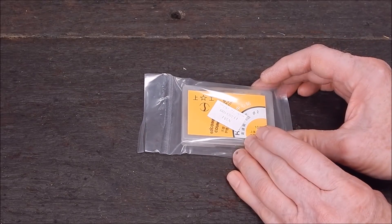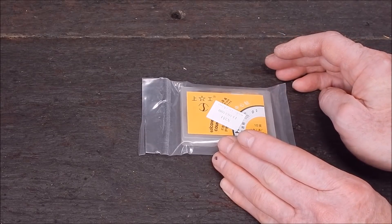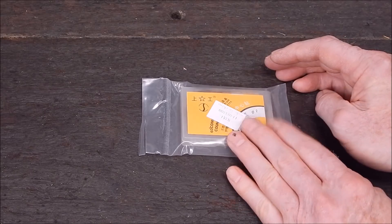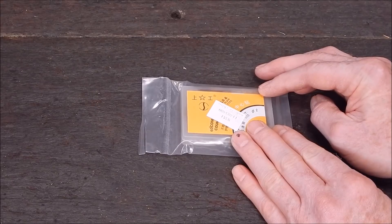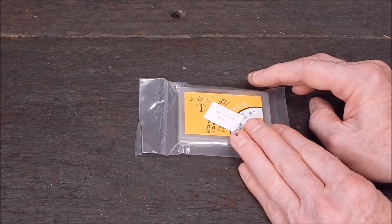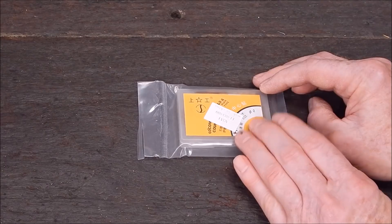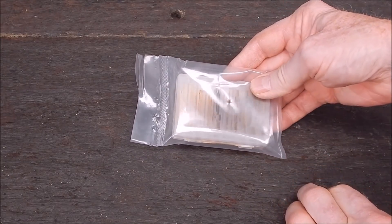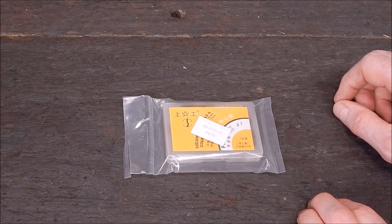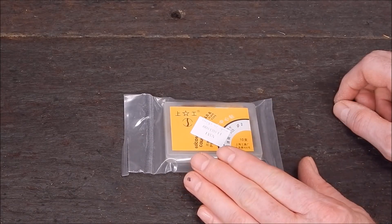They look to be nicely packaged. They're high-speed steel — pretty much all of them you see advertised are high-speed steel, some are gold-plated and look fancy, some are really expensive, and some are cheap. If you're ever going to buy drills, always make sure they have some sort of meaningful rating. High-speed steel drills — unless they are rated for stainless steel, I won't touch them; if they're rated for stainless steel, they'll be good for anything. But with these center drills, most advertised just say 'high-speed steel' or 'hard high-speed steel' — they don't give you a grade rating, and high-speed steel comes in at a lot of different hardness levels; they're not, by any stretch, all the same.